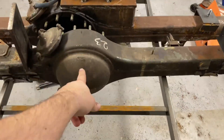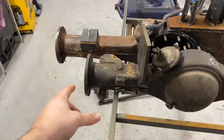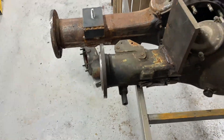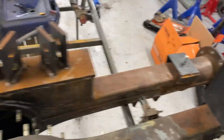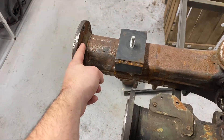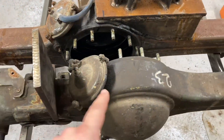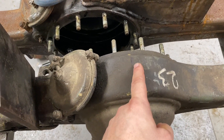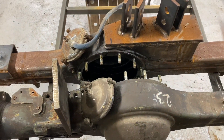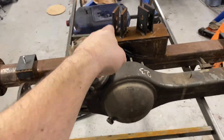So here they are - front axle, rear axle. Since the hubs are wider on the front, the front axle is shorter than the rear axle. I'm going to remove this flange over here and weld on the flange so it will be parallel with this flange. That means this is the center line on the front, this is the center line on the rear. So it's about 7cm that I will get the third member closer to the tire if I take the rear axle and transform it to a front axle.